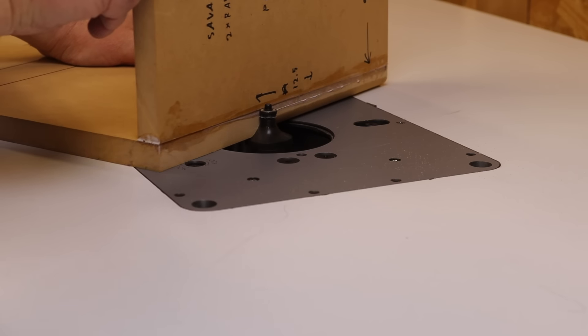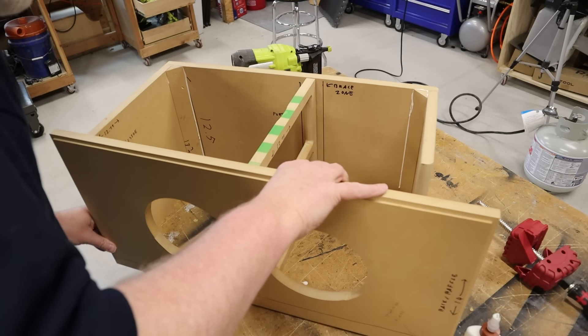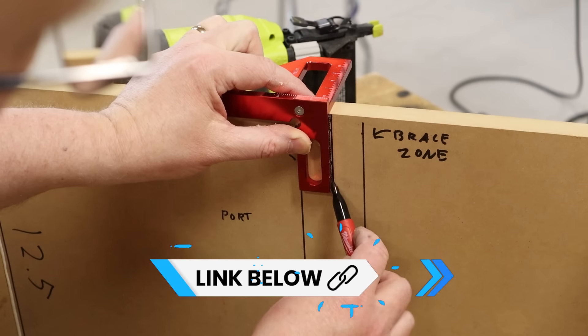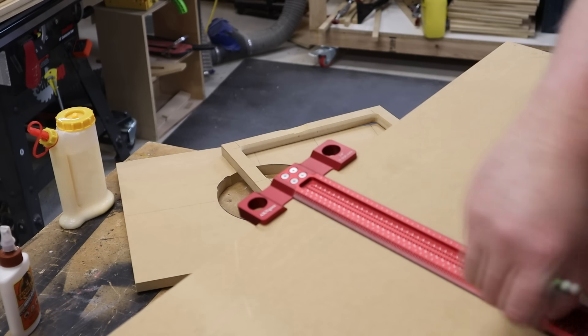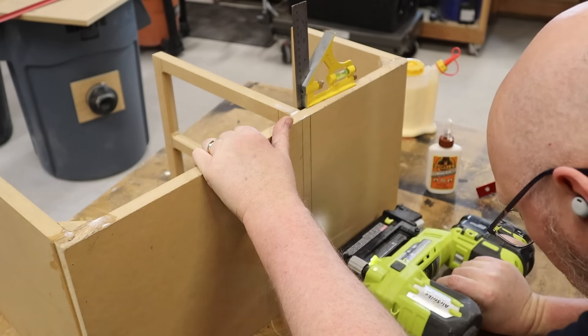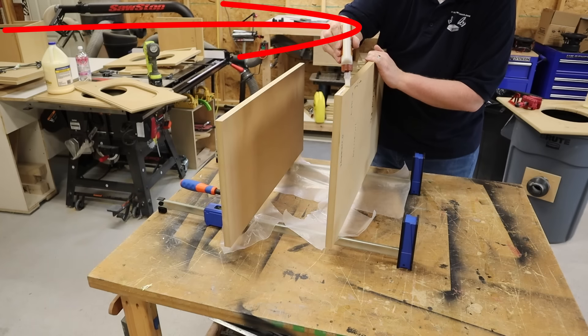Now that the port assembly is finished, now's a good time to do a round over on that inside port bend and add a corner 45. This part is very important: you want to double check your brace location so that brace doesn't interfere with your speaker cutouts. To mark out that brace location, I'm using my new favorite tool — this is a 3D square. Now it's just a matter of putting the rest of the box together. I've got several videos where I show that process, and I'll give you a link to one here if you want to see it.